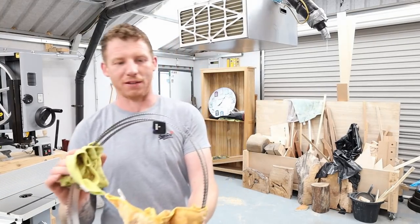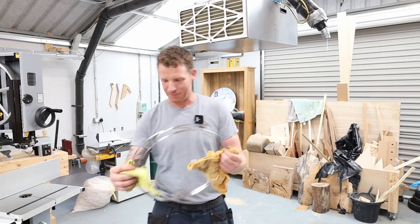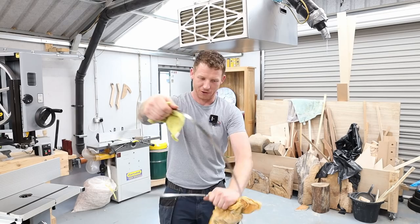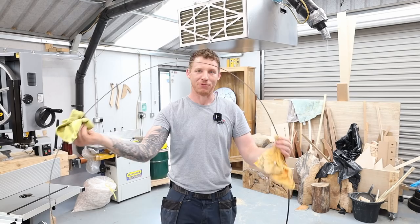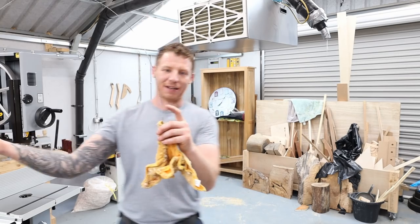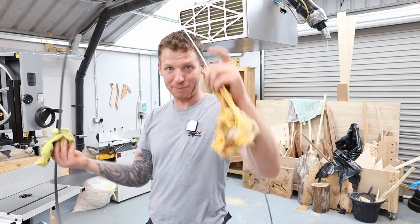Here's our new Excalibur blade — it's quite a bit sharper than the one that came off, so I have two pieces of thick cloth. To uncoil, just take out a loop nice and easy and let it uncoil — you have control of it the whole way. There's no reason to be afraid; don't throw it on the floor and risk damaging your blade. Just let it come out, turn it around gently. When you do take it out, make sure the blade isn't inside out — the teeth should be pointing down, not up. If it's inside out, just flip it back around.